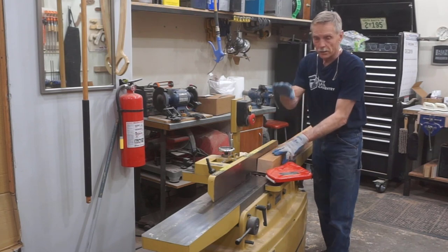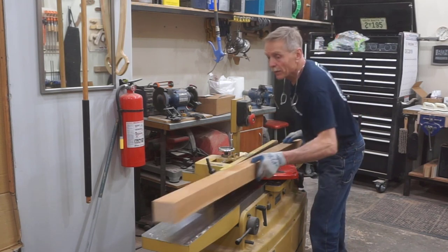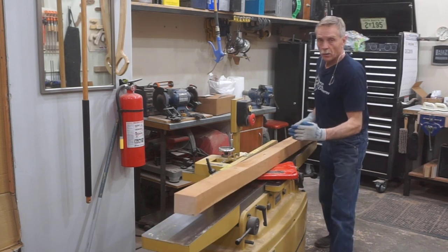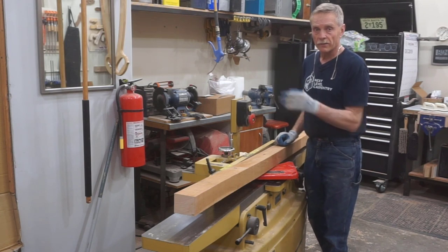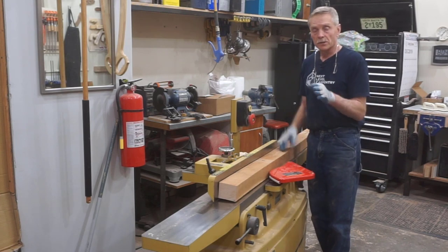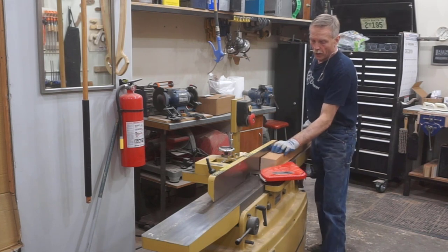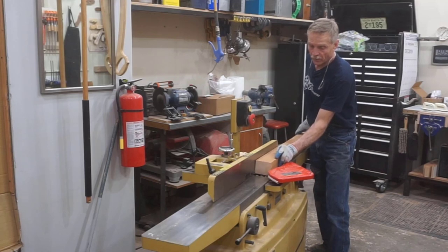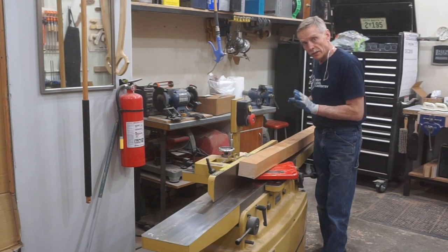But if I can average it out, take a quarter inch of twist out of this corner on this end, and this back underside corner on this end, when the center of the board passes over the cutter head, eventually it won't be taking any wood off. It'll be just straight across. I hope that makes sense. But what I've got to do, from gauging how much twist is in the board with the winding sticks or with an eyeball, is to rock the piece up on the infeed side half of that total twist when I start feeding it. And at this stage, it's as much art as science to gauge that initial cut.